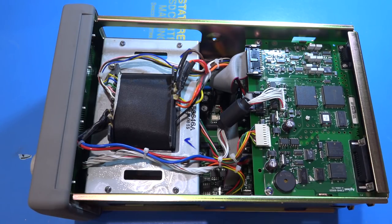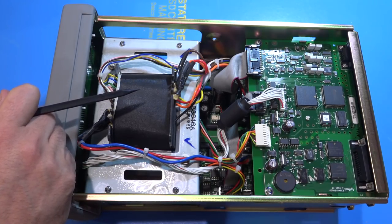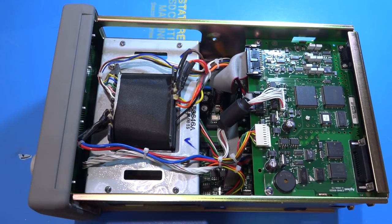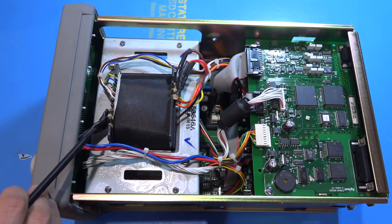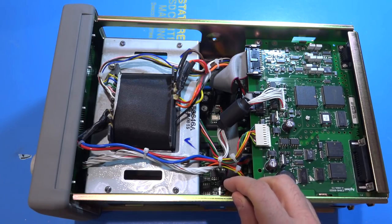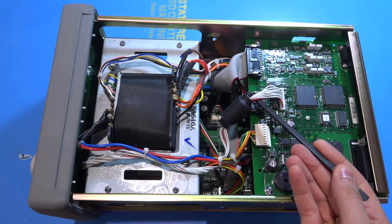Here's a look inside the power supply. There's a very large transformer making up about 75-80% of the weight - required because this is a linear, not switching, supply. It's a custom transformer with a part number specific to this model, so it's impossible to find a replacement if it fails. The construction is as expected: a main PCB at the bottom with all the power transistors and analog functions, and a digital board up top with the processor, GPIB, and serial control.